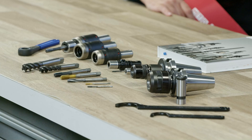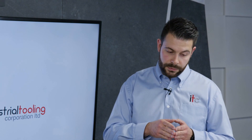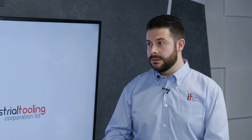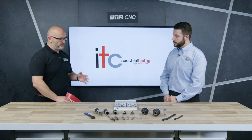The main benefit of the dual contact is that Big Kaiser are the only people who manufacture the gauge which the face and taper spindles are made to. That enables Big Kaiser to make their tools even closer to the spindle, so it's the one and only true face and taper contact.